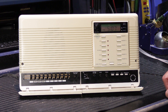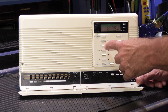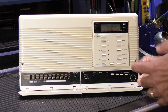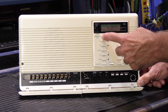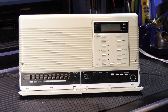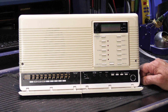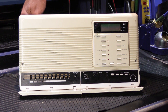Let's go ahead and turn the radio on and you can see what's wrong with it. That buzzing noise is not some weird reception or RF issue — it's on all the inputs: auxiliary, CD, tape. It also shows up if we activate the intercom. Let's go ahead and shut it off because we don't want to damage our poor little 3303 any more than it already is. The buzz is from a complete failure in the primary power supply on the back of the 3303.